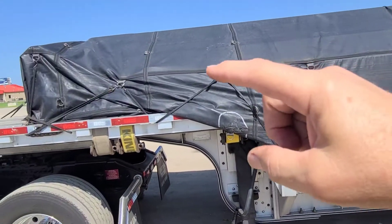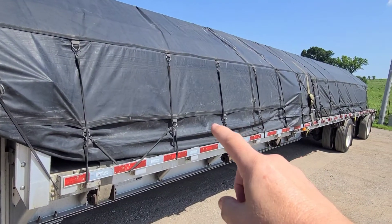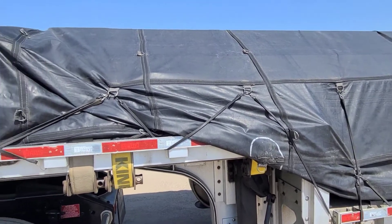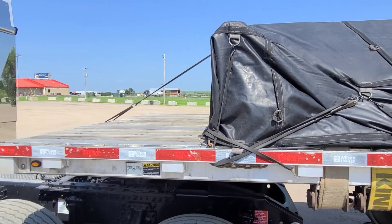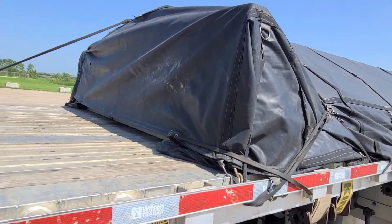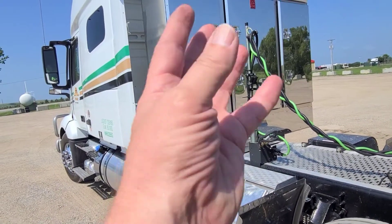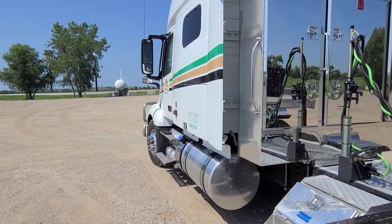So this is laying flat on this deck up here. And we put those levelers about right there and right there in between the axles, and that makes for the load to be distributed even. And we wind up being able to scale this thing out with 45,000 pounds worth of steel. And this bulkhead up here, just in case anything slips, it'll hit that and it won't come up here and go zappo right there into the cab where me and Justin have been sitting.